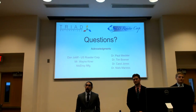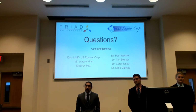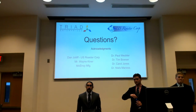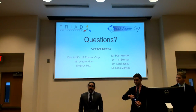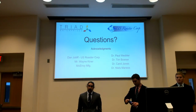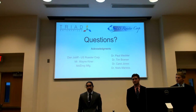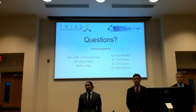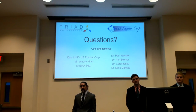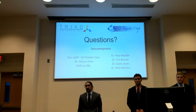I would like to have your comments on the size of cuts you think would work well in the report. Do you think it would have been better served with a longitudinal cut and a ring together, or two longitudinal cuts together? We didn't get to test any kind of spiral cut mill rollers, so we don't really know what effects that would have. At this point, the teeth on the rollers haven't really been the limiting factor. They grip well enough to bog down the motor, so that's not what's limiting us. We have a lot of the right elements, but I think they may just not be well balanced with each other.